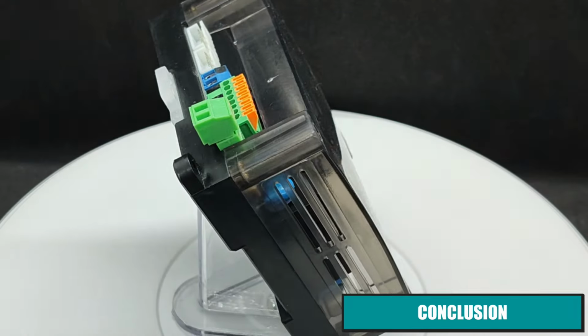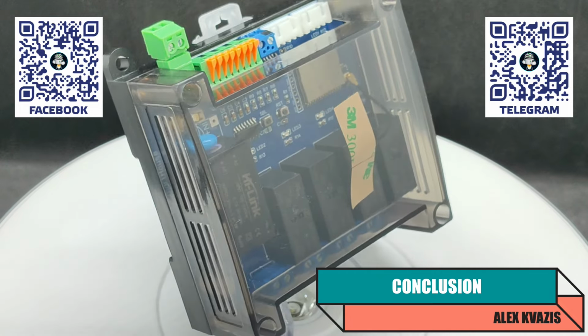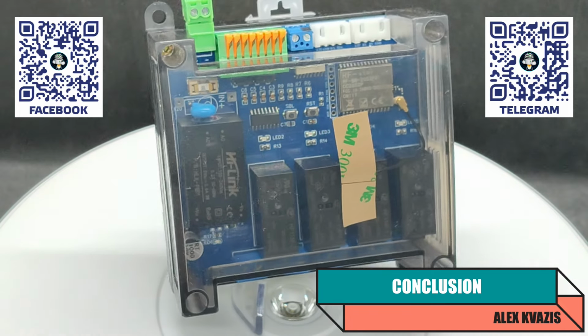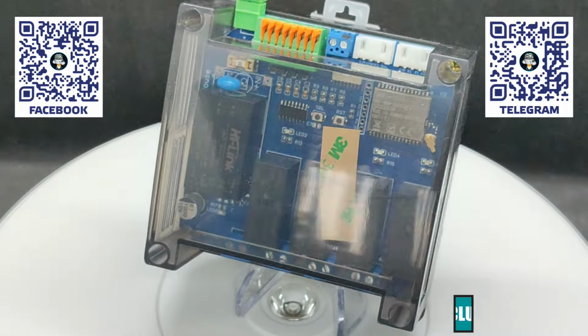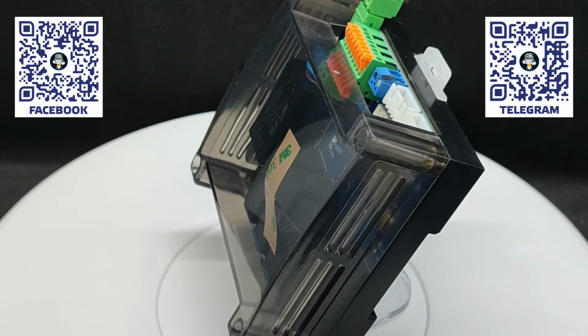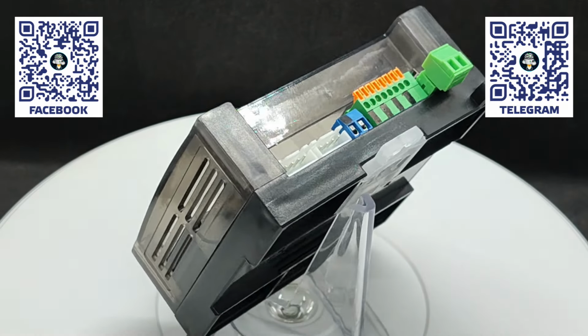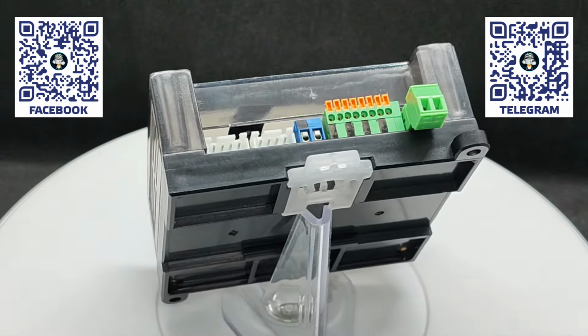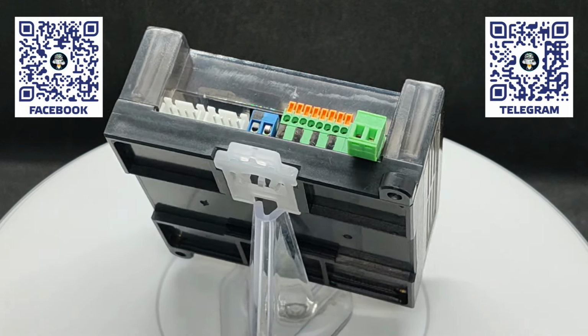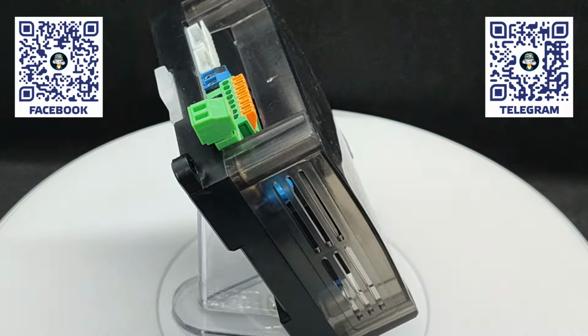I have shown only one firmware option, but there are many more, and the device can be adapted for specific tasks. It can be a multi-zone thermostat, taking into account data from an outdoor sensor, or a multi-channel relay with energy monitoring, though only for one channel or for the main input with physical buttons for manual channel control or for generating logical events. In some cases, one such relay can solve all automation tasks for a separate room.